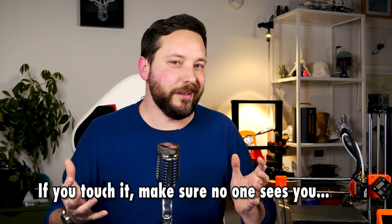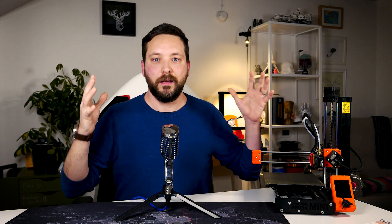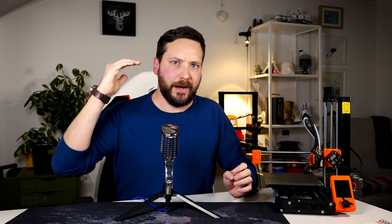Now we have all the information to jump into conclusions. I never had issues with heat creep in my Prusa Mini, so my overall recommendation as an engineer is: if it works, don't touch it. In this case I decided to break that rule because I wanted to upgrade a clone machine and didn't want the clone to be at a higher level than my original, so I decided to upgrade the original instead. Having said that, I consider this a non-necessary upgrade for my experience and my machine — but as you've seen in the pictures, it's quite clear that there is an advantage using the Bontech heat break, dropping the temperature by roughly one-third.